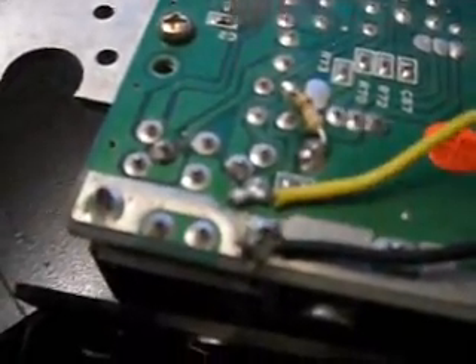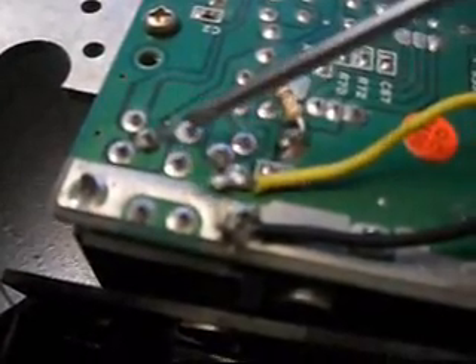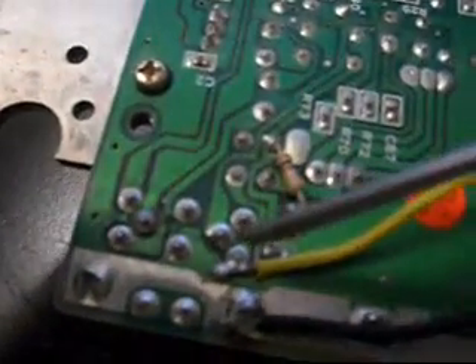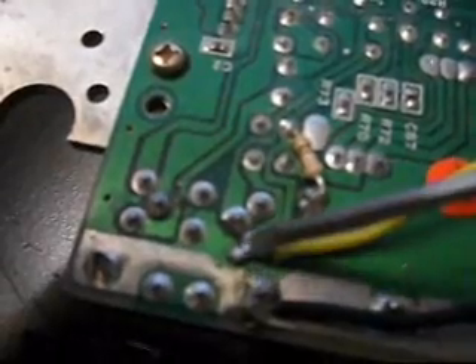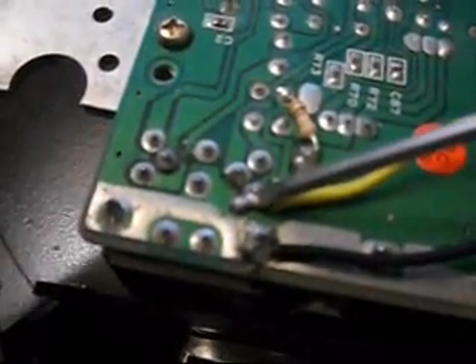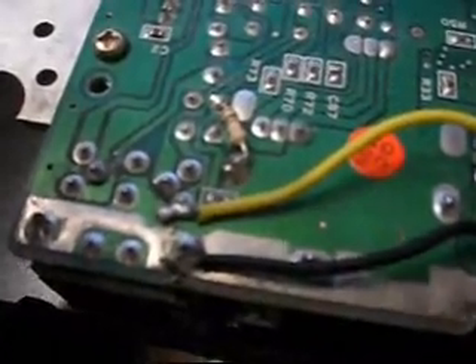I got the ground from this pin. You can also grab the ground from these two centerpieces here — I recommend it from here. The video, I got it from this pin here. There's going to be three pins; make sure you connect it to this pin here. You can always pause this video if you get stuck anywhere — sometimes I do move too fast.